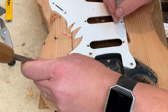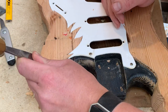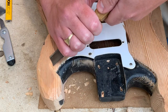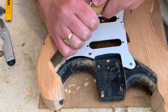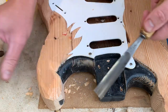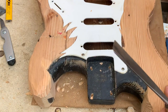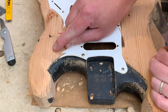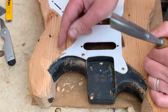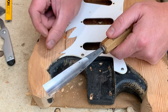Now that might sound like a really silly thing, but it's totally and utterly true. Good woods for carving are things that don't have grain in them, or very, very little smooth grain patterns in them. So where you can see big, thick grain lines in here, what that means is the light stuff is super soft and the darker lines are super hard. So even with a really sharp chisel, it's not going to want to play ball in a lot of occasions.